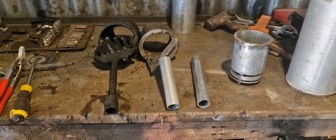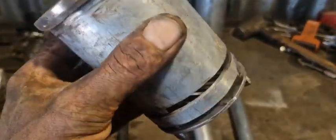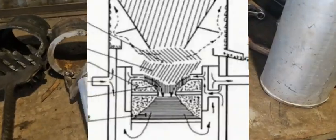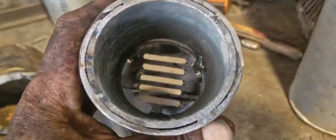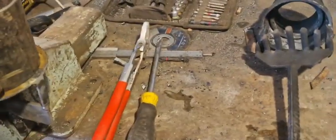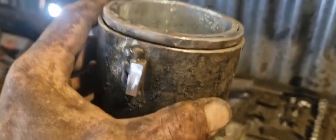Hello, welcome back. Today we're going to test the grate, which was historically described as an improvement on the Imbert gasifier, where the reduction bell is diverging. This design was a great way to improve longevity and cheapness because this is an insert — you can pop it right in, and it will hang in there on the groove. We're going to test it out.